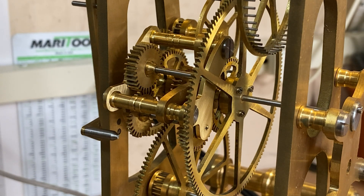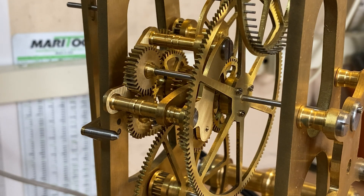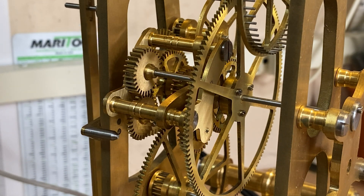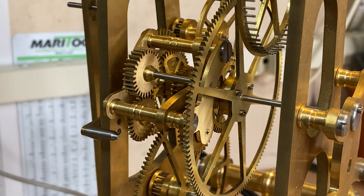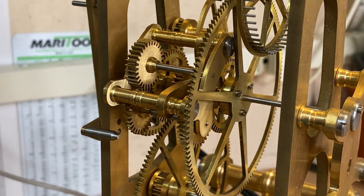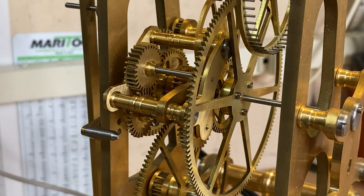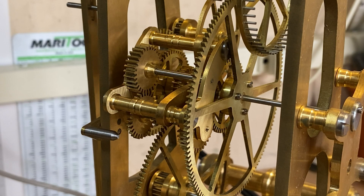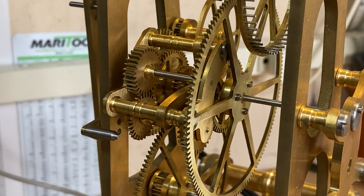I can pull it down and it'll bounce back up from the main wheel — that's what's powering the clock. Typically if you want to run a mainspring you'd put a few turns in to even out the force as it unwinds, but here you've decoupled the mainspring from the escape wheel, so the escape wheel throughout the mainspring winding only sees the gravity of this remontoir dropping down. It looks like it'll run. There is a lot of wasted energy and it won't give a very accurate smooth-running clock, but it's a very interesting mechanism, and I think in a skeleton clock — which you want to be visually appealing — this will give the clock a lot of nice interest.